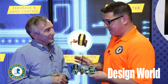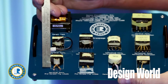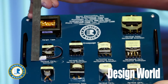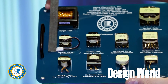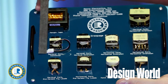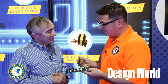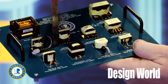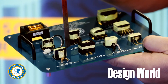It depends on the application. If a customer is pollution degree 2, overvoltage category 2, it's pretty standard for an offline voltage. But we have cases where a customer is connected to distribution and we need 12 millimeters of creepage. Another option where a customer does not want fly leads — because it is more costly to assemble — is a vertical extended creepage bobbin, where the plastic is actually extended vertically by 8 or 10 millimeters.